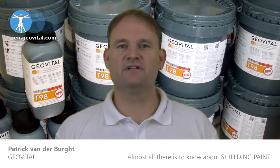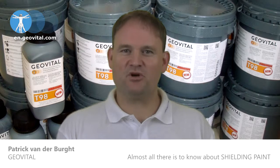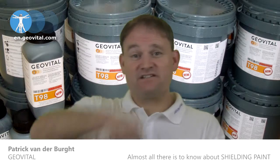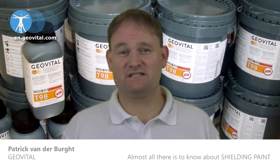Preparing the paint itself: the paint needs to be stirred thoroughly before using it to make sure that the particles that may have settled on the bottom are again evenly distributed through the paint. You can shake the container upside down, but this is best done before the seal of the lid is broken so it has no ability to spill.